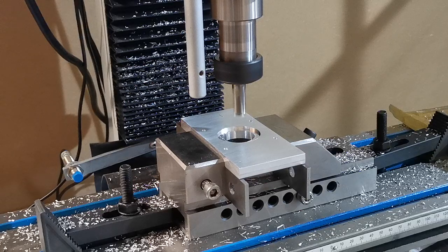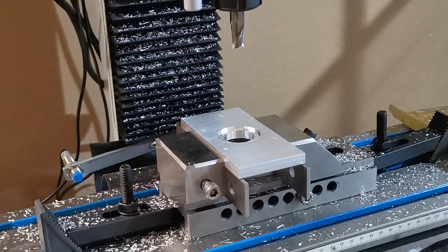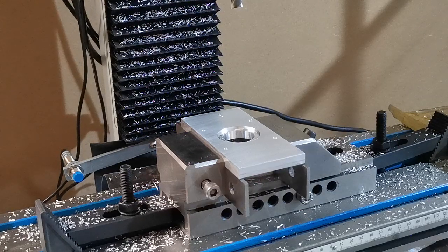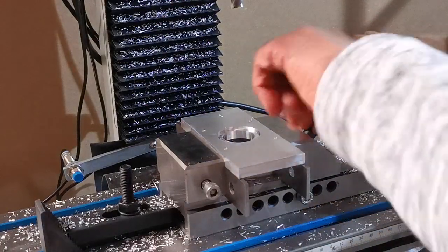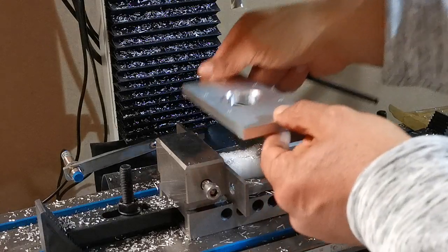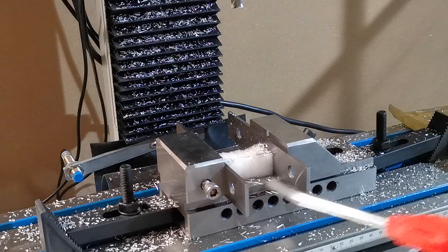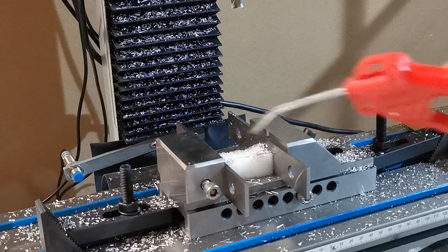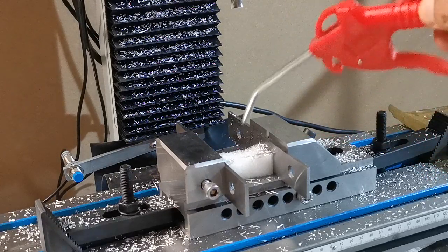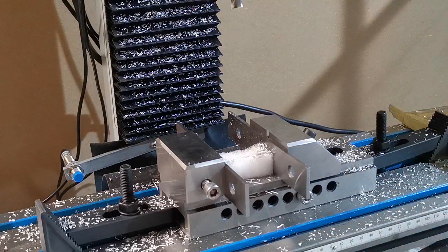It's just finished. We'll turn off the spindle and lift the head up to give you a better view. You can see we have two parallels with a small bit of foam to stop the parallels moving — especially important when cutting all the way through so you don't chew into the parallel. They're held as firmly as you need.